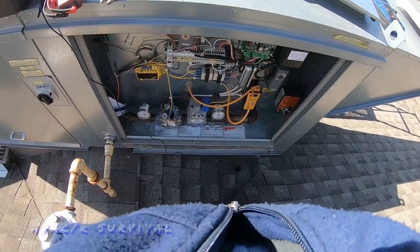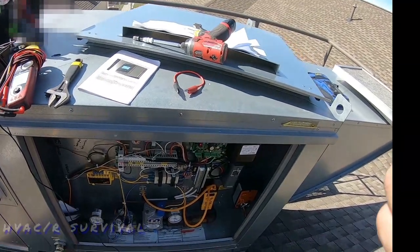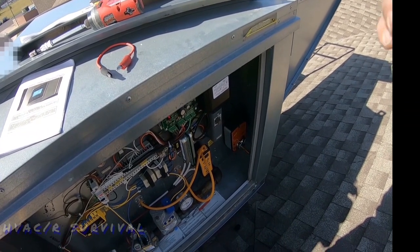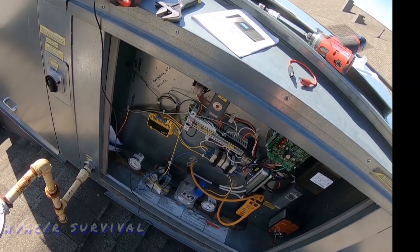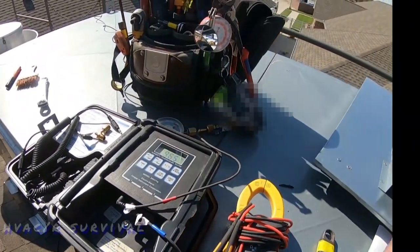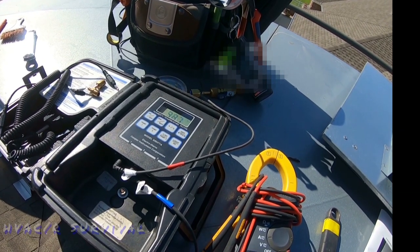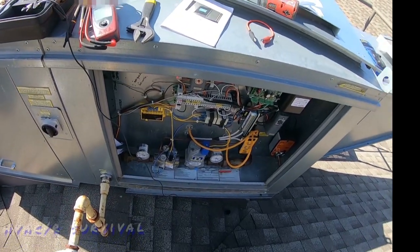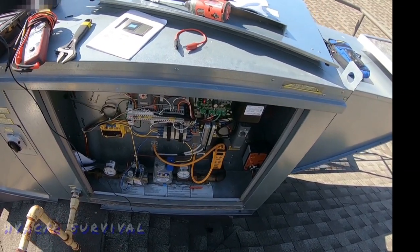What we ended up having to do was adjust the pilot flame — it wasn't always acting up, which made it a little difficult to find. I also found a room thermostat that monitors room temperature but was not mounted where it should be, so we corrected that. Now cranked up to 90 degrees and she's shooting right up there. It was locking out due to a weak flame; once I adjusted the pilot flame on the gas valve, I had a good flame and it no longer locked out. Everything appears to be taken care of.